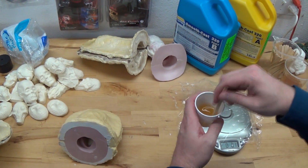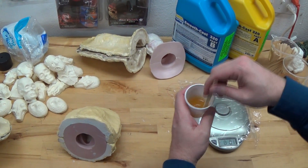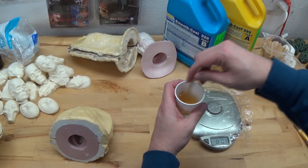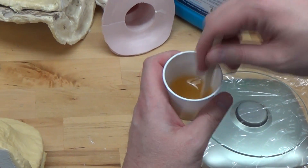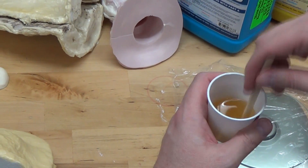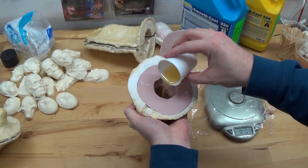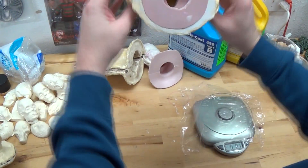Here comes my second batch. And if you can see, I'm rotating the cup with my thumb and my fingers, and then I'm also stirring — that way I'm really making sure that I'm getting all the sides, everything good and mixed. The nice thing about this is that the resin that has just fired off on the inside is pretty darn hot and it's in the gelling stage, so we are going to take advantage of that. We're going to pour it in, and the heat from the first batch is going to help cure a little faster. So same song — we're just going to go ahead and pour it in, keep twisting, keep spinning, keep rotating.